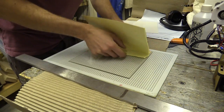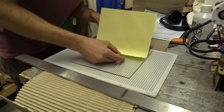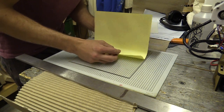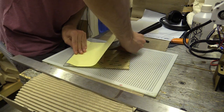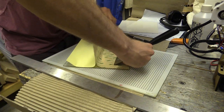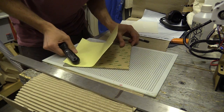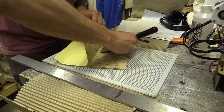From the reading I've done this seems like the best stuff to use as a print bed, but I have to stick it onto a piece of 3mm borosilicate glass. Borosilicate is a thermal resistant glass, and notably the vessel for hot cups of Earl Grey drank by Captain Picard in Star Trek: The Next Generation. It goes without saying if you're going to build a replicator you need borosilicate, hot. It is also flat and will resist warping unlike the aluminium heat bed.